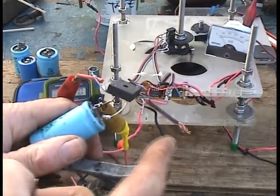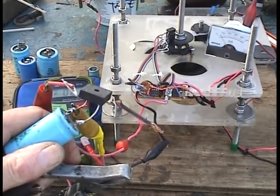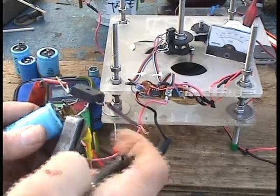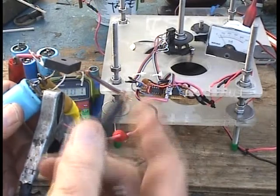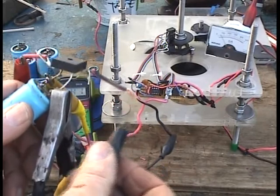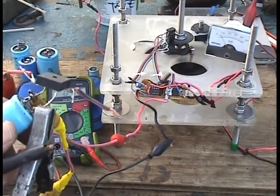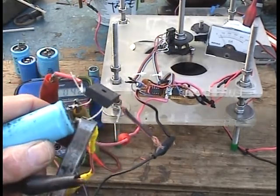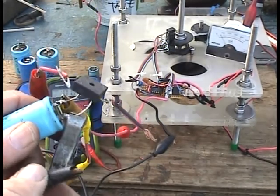I disconnect one of these AC legs. I can discharge it without affecting anything — that's down to zero. Now watch: fill it up. It's just going to flinch a little — watch that up there. It flinched up as it filled, up to 46V in that short amount of time. Now I have this disconnected, so it's okay to discharge. Down to zero.